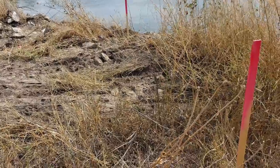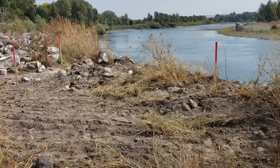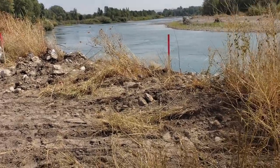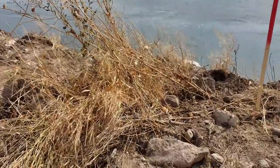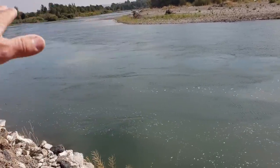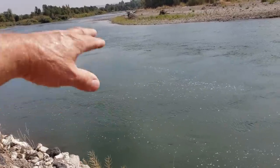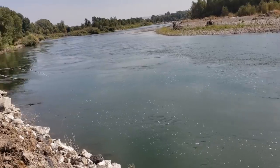So these are the downstream side of it. The stake without paint is the center line, so you can kind of see how it goes upstream. What they want you to do is this has to go on a steady downhill incline for 68 feet. I just don't know how we're going to do that — every other one I've put in or seen done, you basically go in about water level and go out and leave it kind of flat, because as the water comes across it, it changes directions. But I can also kind of see their methodology in having it angled, because during low water it's going to hit that end and push it over, and during high water as it comes up it'll keep pushing it over. So we're going to do the best we can.